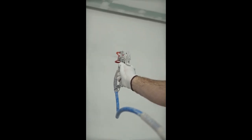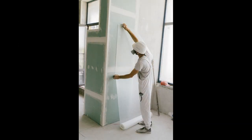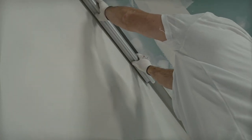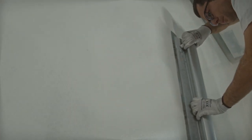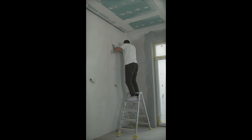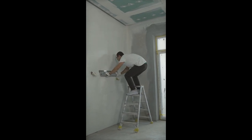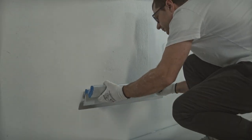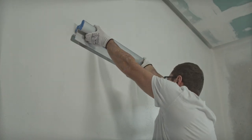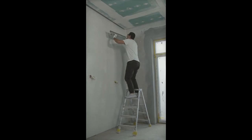When coating the entire area, keep moving in one direction and overlap the previous application. Level and smooth the surface before the compound dries. When the first coat is dry, sand to a smooth, level surface and remove sanding dust. Apply the second coat perpendicular to the first coat. Apply the third coat in the same method as the second coat, smoothing carefully before the surface hardens. Rough or uneven surfaces may require more than three coats. Voids in the concrete may create craters in the USG Sheetrock brand cover coat compound, which may also require the application of more than three coats for a satisfactory surface. Apply additional coats as described for the second coat application.